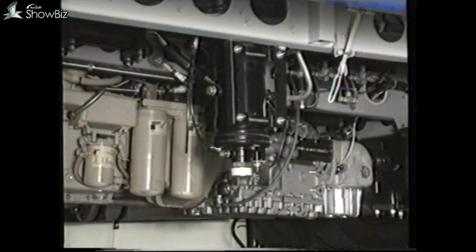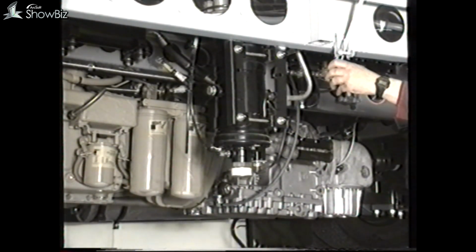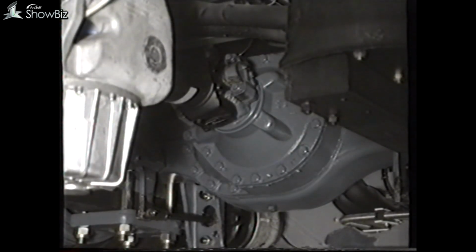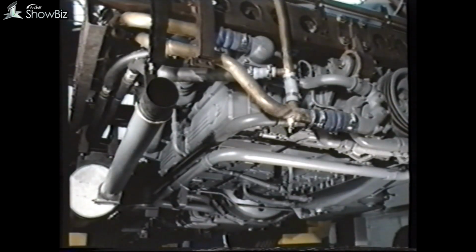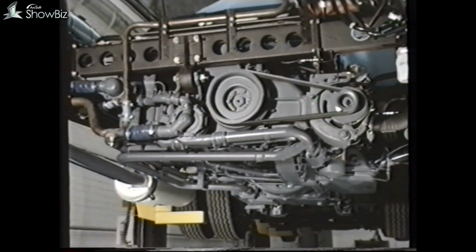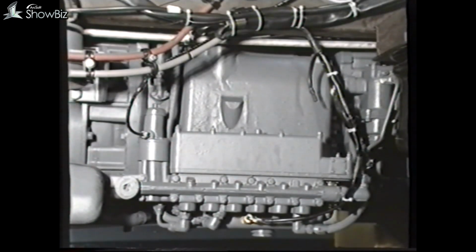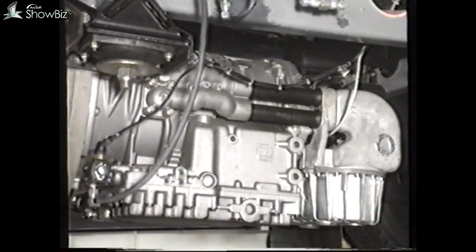All Lynx vehicles are powered by rear-mounted horizontal turbocharged engines, driving through a fully automatic gearbox to a hub reduction axle. The range of engines and gearboxes varies depending on the vehicle age and specification. For example, on early production vehicles, a Leyland TL11 or Gardner 6 HLXCT engine were used, driving through a fluid clutch to a 4-speed hydrocyclic gearbox. This latter unit was replaced by a 4- or 5-speed ZF automatic gearbox, depending upon engine power output.